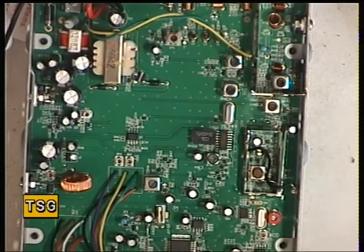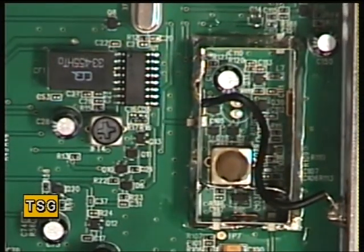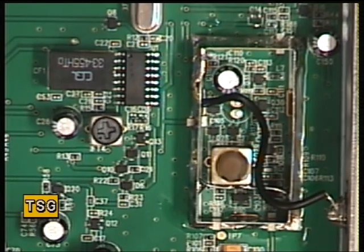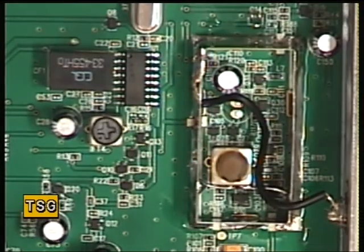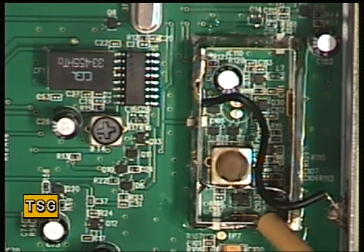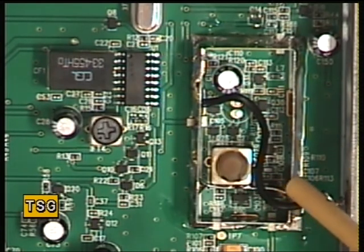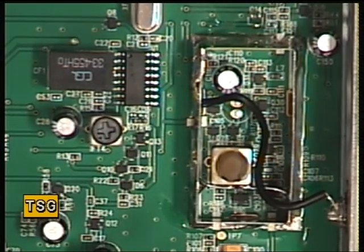On the TTI sets — and I'm zooming on the VCO here — when they get to be about 2 or 3 years old, you start to get microphony. That's where you tap the radio while on transmit and it goes clonkity-clonk. The ceramic capacitors in the VCO section can absorb moisture and become microphonic. This happens with all kinds of equipment. With it being surface mount, you can't change the capacitors, so you're effectively writing the sets off after only 2 or 3 years.